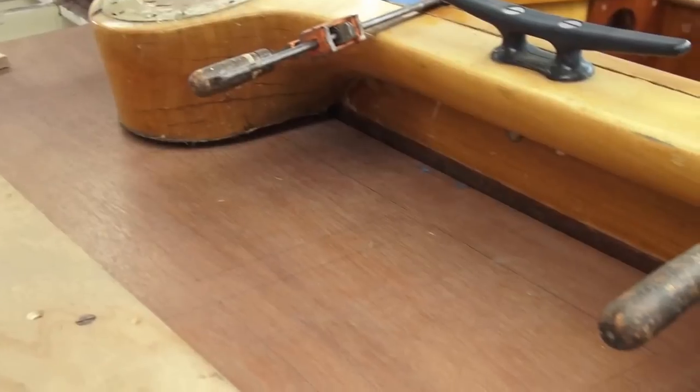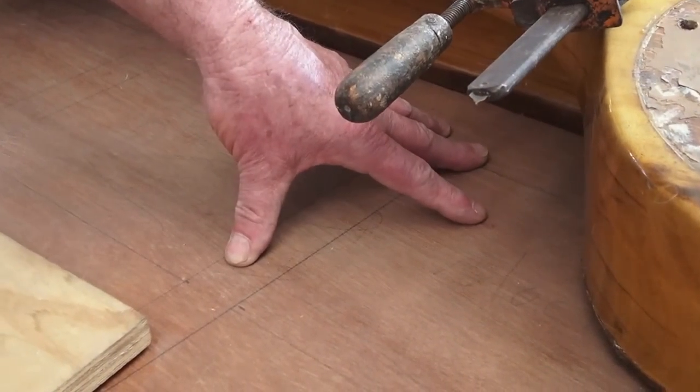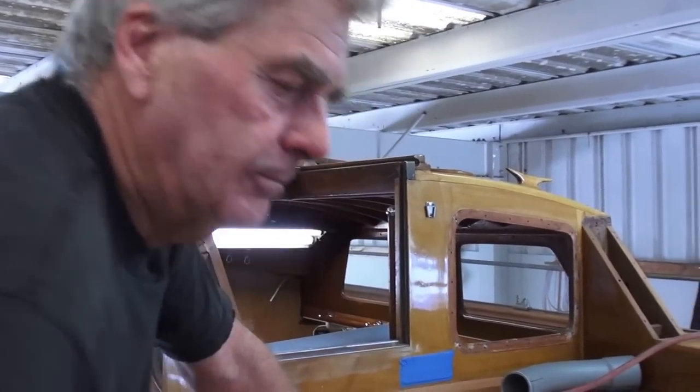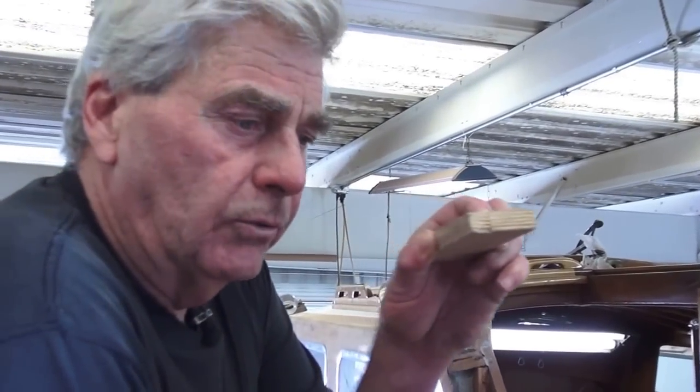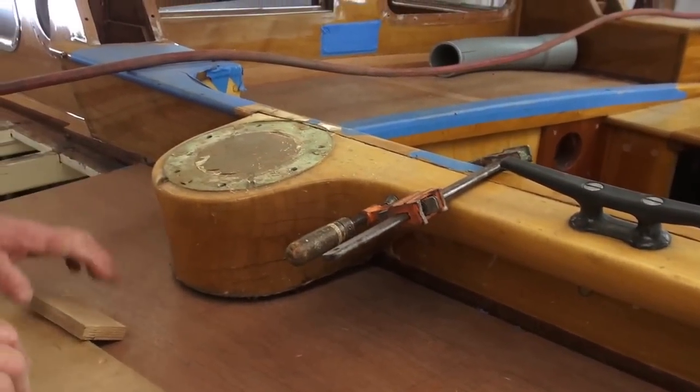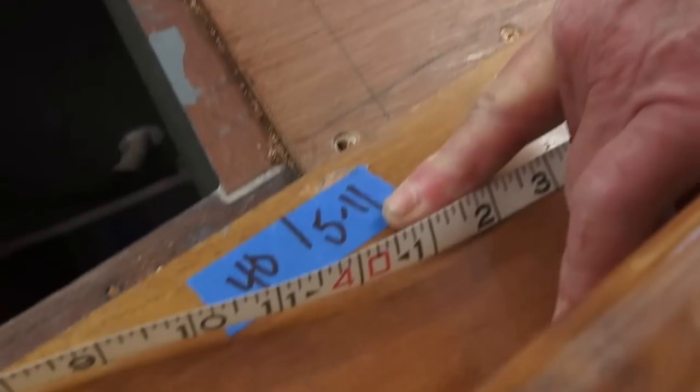It's a little bit overkill, I'll admit. But some of these beams weren't in the best of shape and they had these little skinny blocks underneath. Rather than cobble all that back together, we just spanned the whole thing with some fir and clear blocking. Now there's no question it's putting strong, and we didn't really add any significant weight. Before the deck is put down, we scribed them so a three-quarter-inch piece of wood will just go underneath there. That way with a little bit of sanding we know these will go back in quickly without wasting time. Are you ready to screw all these boards down now? We're getting closer every minute.